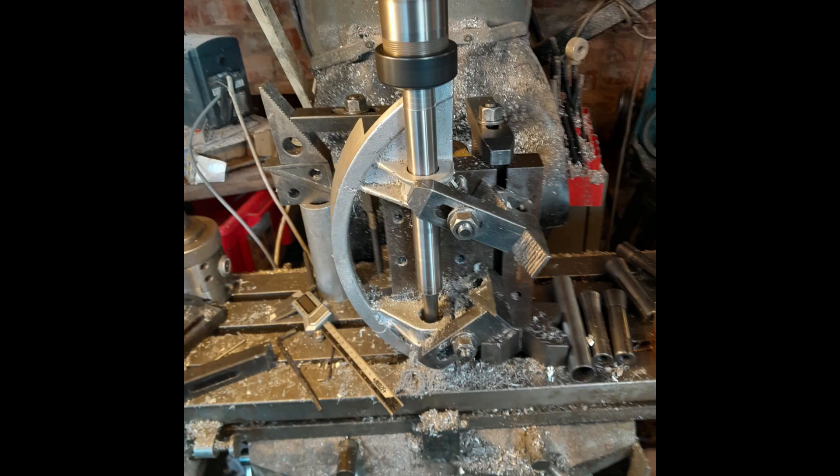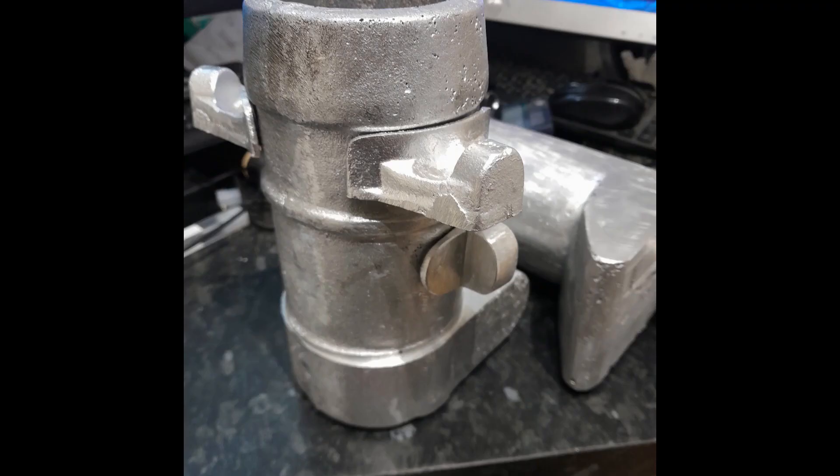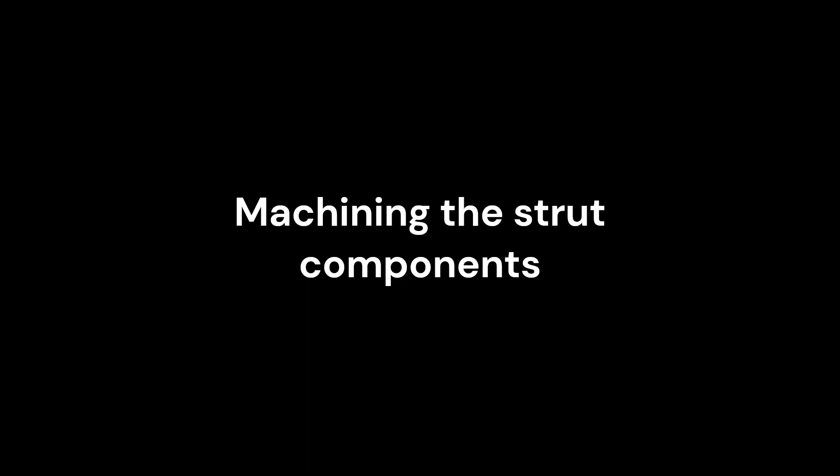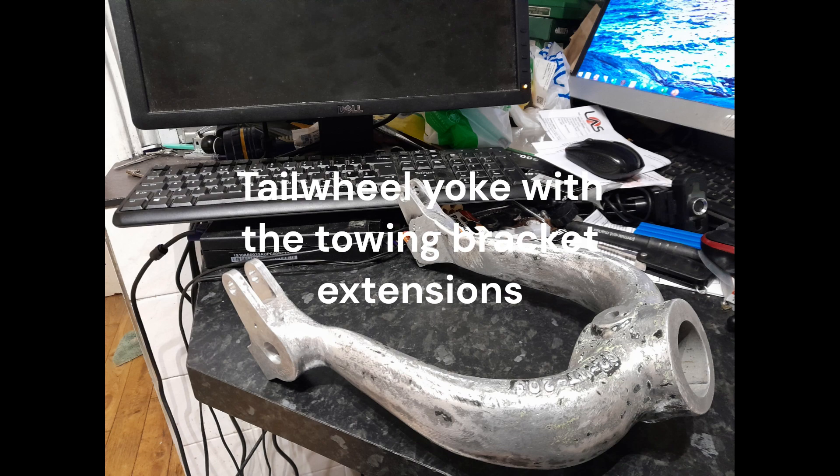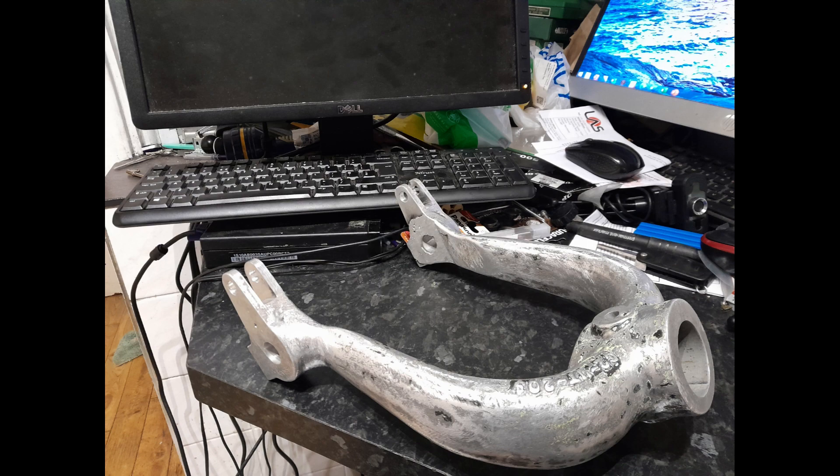The fixed lower strut casting carries two angle brackets that attach to swivel rods connected to the bay doors. There is no mechanical lock provided for locating the strut in the raised position, just the line pressure for the jack, isolated by an instantaneous cut-off valve. While an ingenious system, it is very heavy and complex compared to the non-retracting tailwheels of its contemporaries.